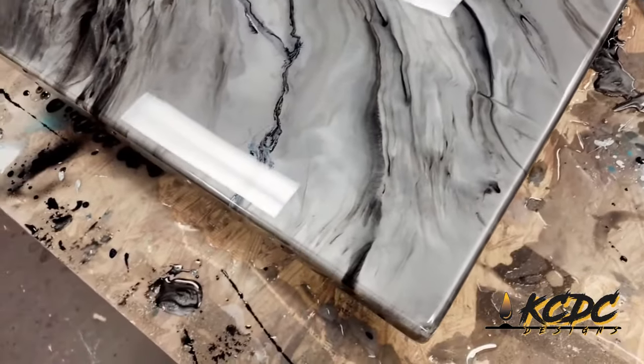I was not able to use a paint tray because I've only got such a small amount of Top Coat to use — I don't advise this unless you're really comfortable with the Ultimate Top Coat. I'm just pouring it directly onto the surface and that's how I'll get my roller saturated. I've applied enough UTC that I know what amount I need to get an absolutely smooth surface. I'm using my wet roller, getting that put down on a back roll one more time, then going over it with no pressure whatsoever with my dry roller. Once I do that, it's time to walk away. What you'll see next is a time lapse over the next 15 minutes showing how that UTC dries completely clear, perfectly smooth, no orange peel, no roller marks, and no lap lines. Turned out fantastic.